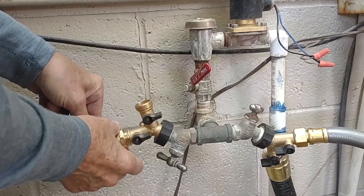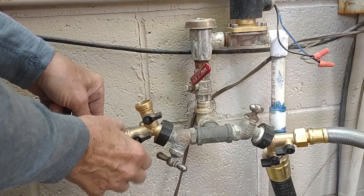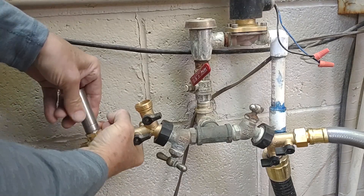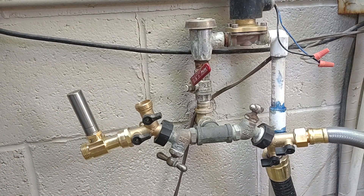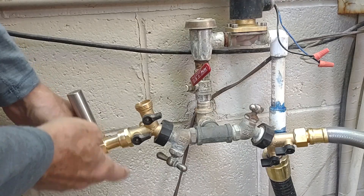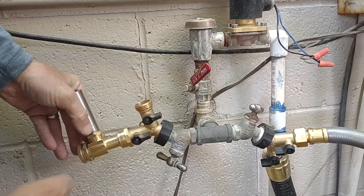This is a convenient place to hook up the water hammer arrester because it's right on the same circuit. This is turned off right now, obviously I'm not getting soaked. I'll get this thing screwed in and make sure it's nice and snug. I'm also going to put a cap on it because it's not going in line with something that's going to stay there. You can put this in line with your washing machine hoses, for example — that's kind of how this one is designed.